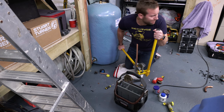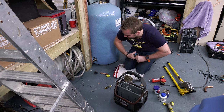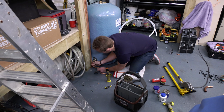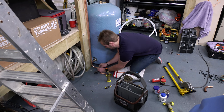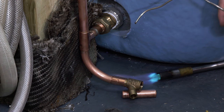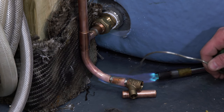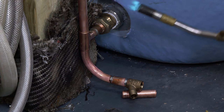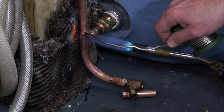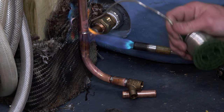And don't worry guys, I'll be showing you a diagram of the whole system layout in a minute. It's standard procedure really when it comes to soldering. I know a lot of you guys like to have solders where you can't see any solder whatsoever, but I just don't subscribe to that - I just love to see a little bit of solder and make sure that we don't have any leaks. Even though I did make a bit of a mistake here - you'll see a tiny bit of snot on the back of the downward run of this tee that I'm doing. That's because I didn't wipe off the excess flux on the downward part of the pipe. So always remember, once you're about to do any soldering, when you've put all your fittings together and they've all been fluxed up, give them a bit of a wipe first before you put the heat on and the solder in.